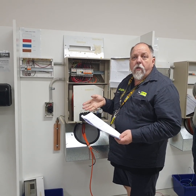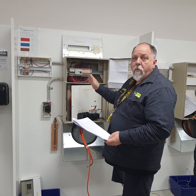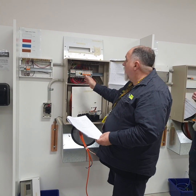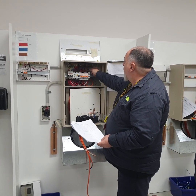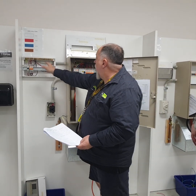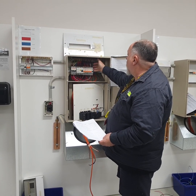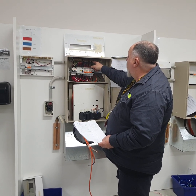because if you look in the wiring rules, they normally like to have the earths and the neutrals and actives line up with each other. Do you understand what I'm getting at? All right. So we look in here. So that, for example, this one here on the last one coming through would match in. So this would disappear up into the subboard, and the same with the last one. So it's important that all these line up in correct order.